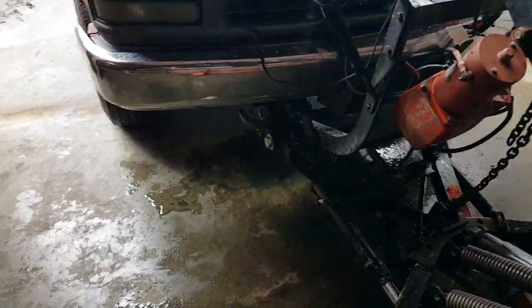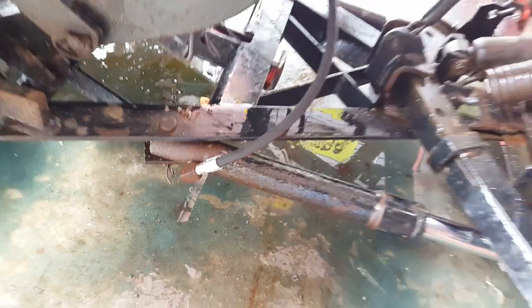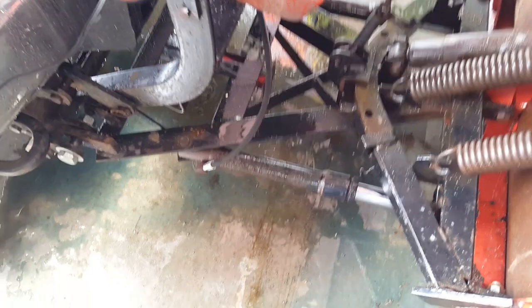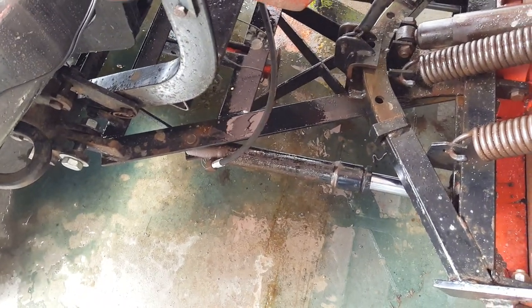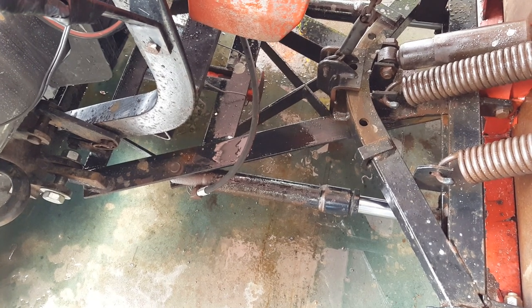So what I ended up having to do is I actually took off the lines down here at the bottom for each of the bottom of the rams. There was a ton of moisture and sludge in it. Take each one of those off and you can freely move it. Just make sure you don't draw in air when you move it from one side to the other.